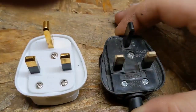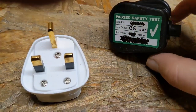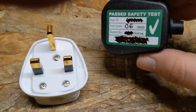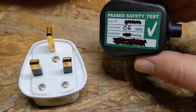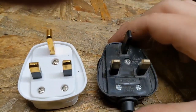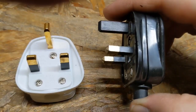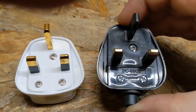These aren't UK compliant. Although when I turned this over it had passed a PAT test, so obviously the person doing it didn't catch this when they changed and tested the plugs. I'm not wishing to ridicule anyone and I've covered up the name, but they obviously didn't quite know what they were looking at. It's an easy thing to miss — I was a bit skeptical when I first saw them, so I spent ages looking through the standards to see if you could actually have a plastic pin, and it turns out you can't.